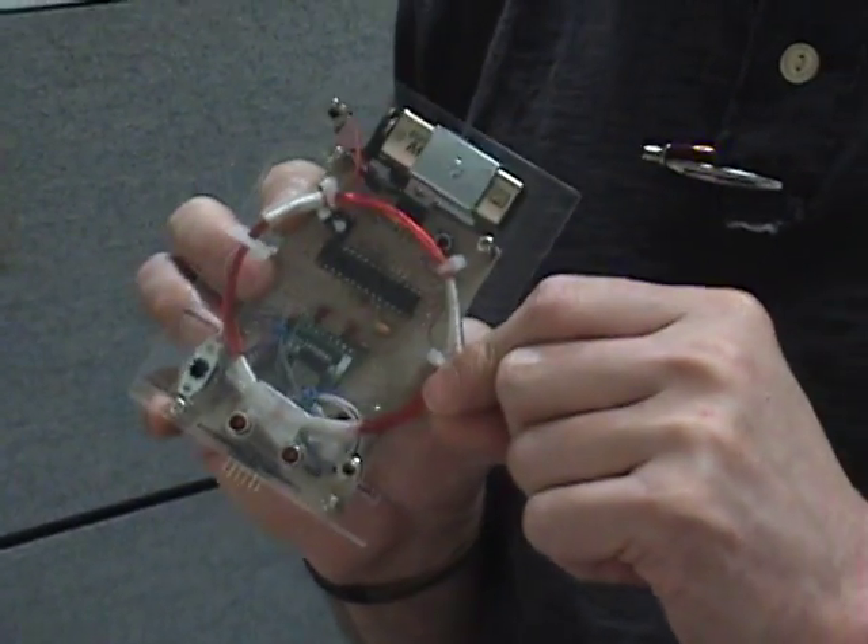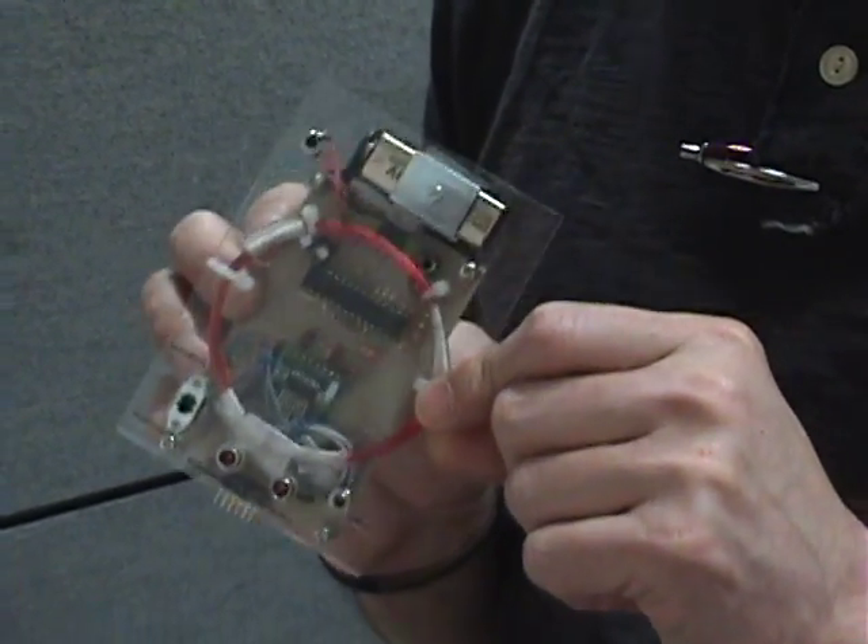People are always trying to figure out different ideas and applications for using RFID technology. Wireless entry into your automobile, for example — putting an RFID card in your back pocket while your car has an RFID receiver built into the seat, recognizes you, and starts your car. There are lots of other really interesting applications. You kind of use it as a key, which as a security measure is basically what it is. And what we find out is it's easy to capture this data. So to really be secure, you have to do something more than just use an RFID tag — probably a keypad. Think of it like when you get money out of your ATM: you have the card, but the card itself doesn't get you the money — you have to know your PIN number. So some kind of a keypad would make this a little more secure.